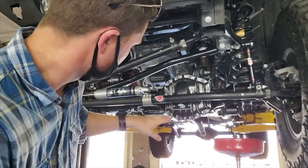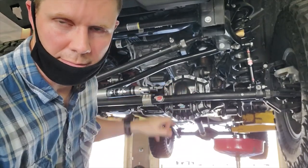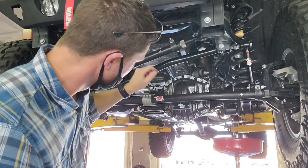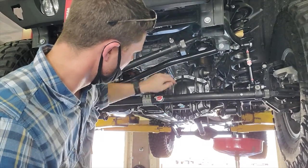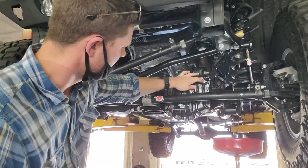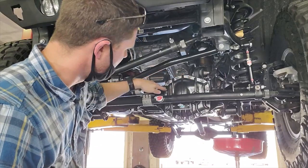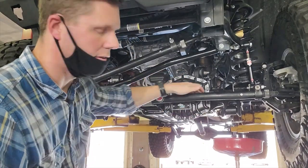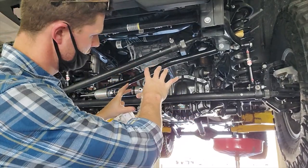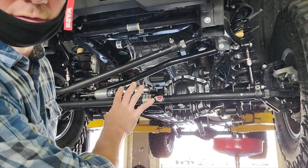One quick note: I was doing a star pattern — going from the opposing bolt all the way around, just like you would on a tire. Instead of 5 lugs, you have 12, so you go 1, 2, 3, 4, then go to opposing 5, 6, 7, 8, 9, 10, 11, 12 — in a round star pattern. However you want to do it, as long as you hit every bolt twice in your star pattern, then you've got it torqued on there properly.